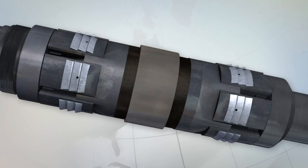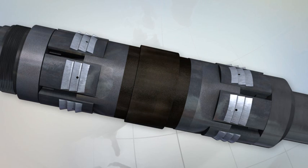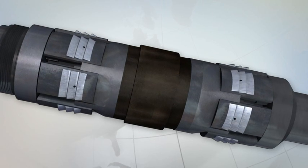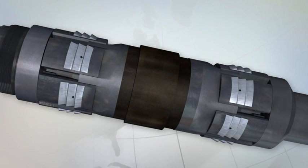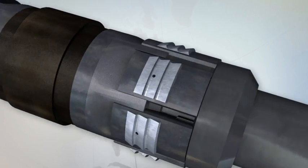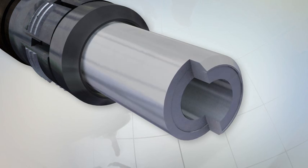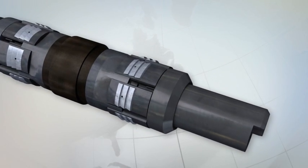The innovative elastomer design has been the cornerstone of Baker Hughes composite plugs success. This composite plug design is unique in the marketplace because it does not require any backups to support the elastomer during pack off. The continuous diameter packing element allows for high flow rate bypass without the possibility of pre-setting or swabbing. This is extremely critical during horizontal deployment completions, which require higher pump rates to navigate the horizontal wellbores. The clutch cut on the upper and lower end acts as an anti-rotation mechanism, maximizing the removal efficiency.